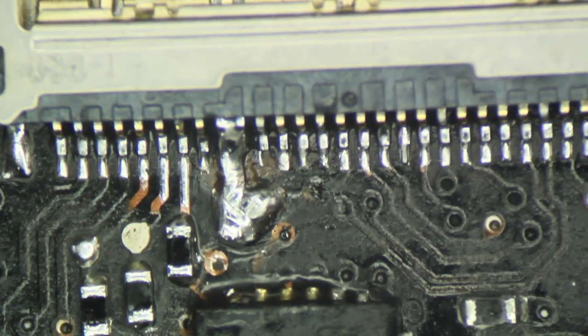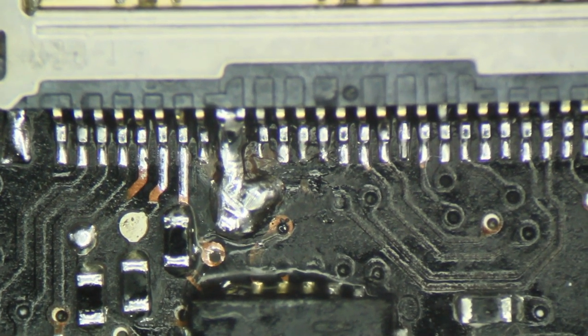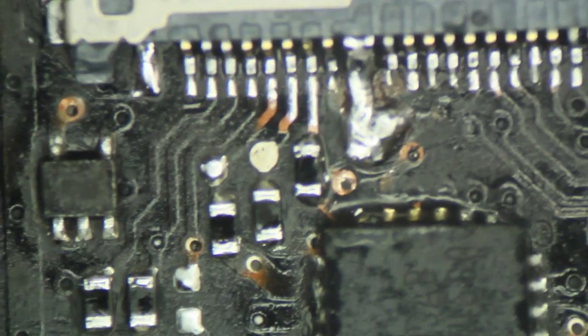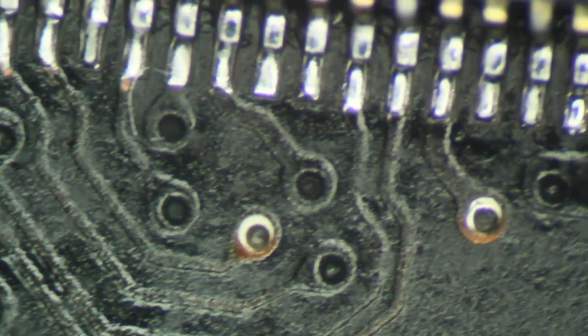And we leave the two pins near the main power of our board. So these two pins actually we should connect to the ground, but for safety reasons, we just leave them there, because if you connect them to the ground, you need another fly wire. It's too close to the main power supply. If not soldered properly, it may cause a short circuit. So we just leave it there.